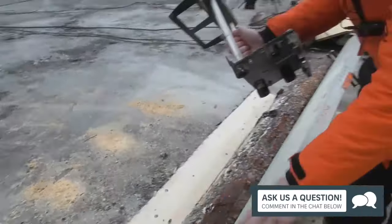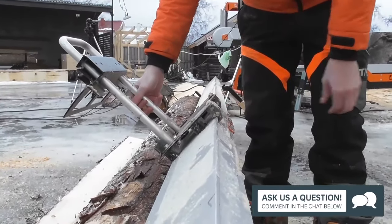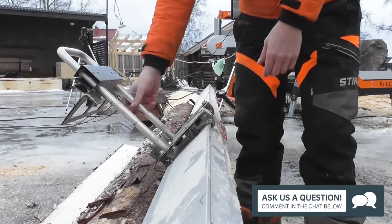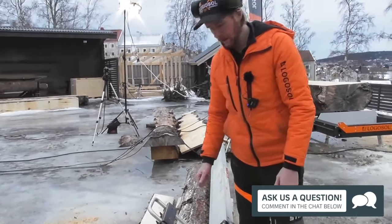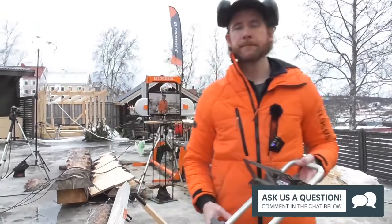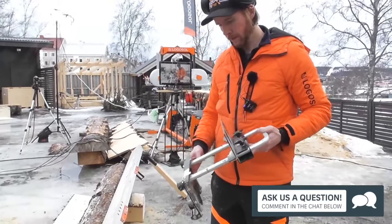When you use the guide rail kit, you also get these aluminium profiles that fit against the flanges on the guide rails. That's why we've tilted this a little bit, so it's a more comfortable position when you're cutting instead of being on your knees. I would say a key tip when using the TIMBERJIG is to create a good working position before starting to cut. Yes, absolutely.